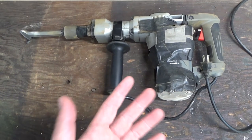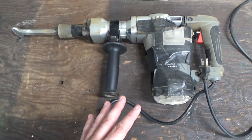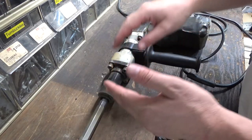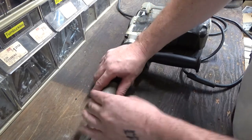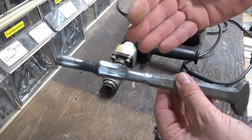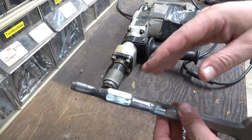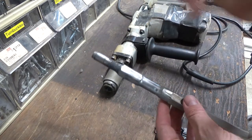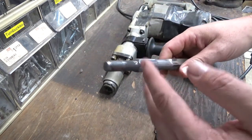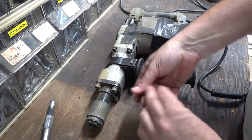This is actually the first time in several years that I've had to take one out of rotation because it started to wear out. About the only downside I've found is they use a very weird non-standard chisel chuck — what I believe is called a 17-millimeter hex. So it's not SDS, it's not anything standard. It's apparently used by a couple other chisels, something that Harbor Freight sells. You can get other blades than the ones that come with it — just search for 17-millimeter hex on eBay or similar.